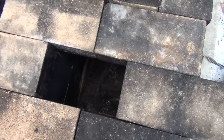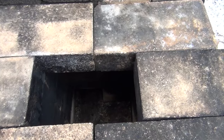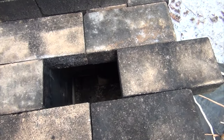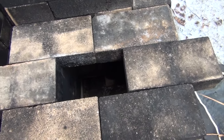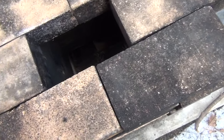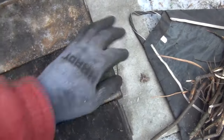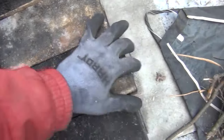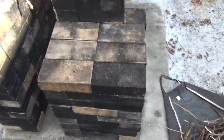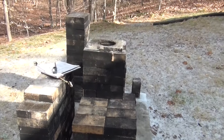Load the wood up top here like a hopper, like a coal hopper. If it works, I'll break it all down so you can see how, and I'll film it while you can't see the hole down there. The idea is everything burns across the bottom, so the sticks should last about 3 times as long as, say, putting them in a batch box where everything burns at once. It should only burn across the bottom.